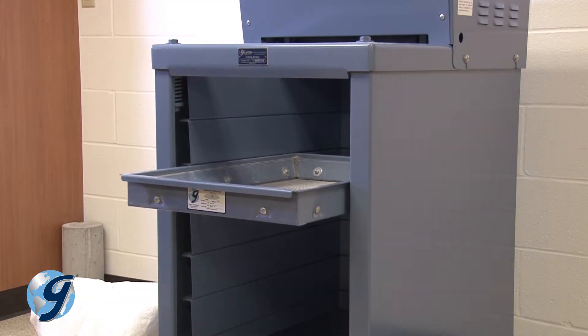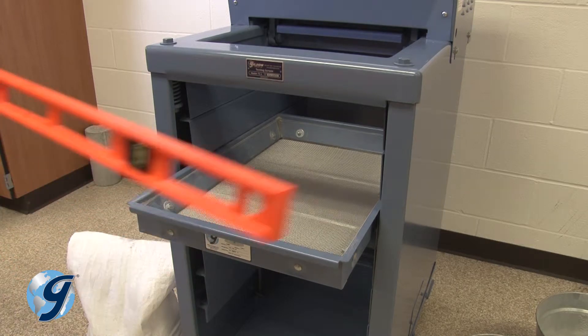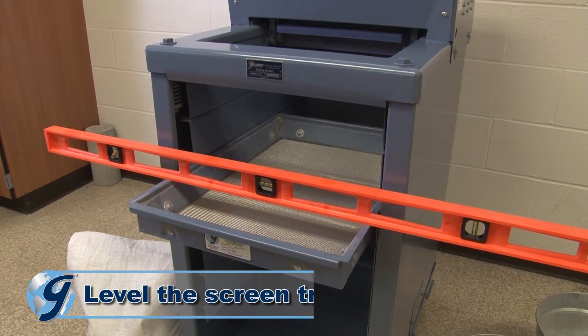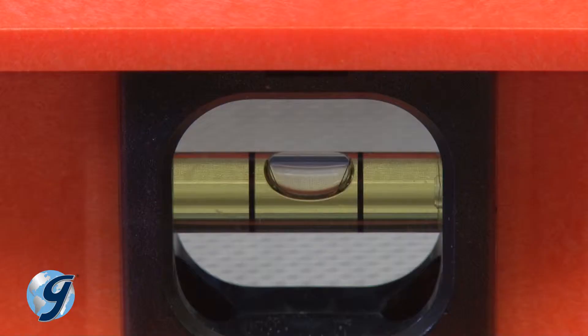Use your sense of touch to determine when the single screen tray is firmly clamped. Now, using a carpenter's level on the extended screen tray, resting it on the tray's flanges, level the testing screen side to side and front to back by adding or removing metal shims until the screen tray is level.